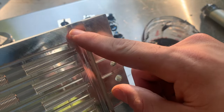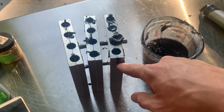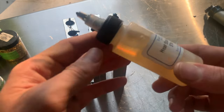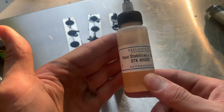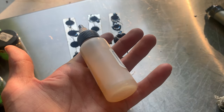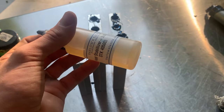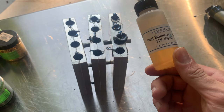These are just top pourers — basically I'm just injecting it here and the swim bait is right here, so the top right here is already enough to fill that complete swim bait. Another thing that is handy to have, costs you $5 to $6 more, is some heat stabilizer. When you're reheating plastic or doing a remelt with baits that are old or store-bought, I highly recommend using heat stabilizer — just something handy to have that no one really talks about.